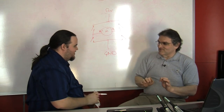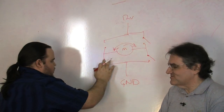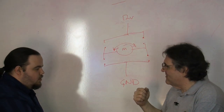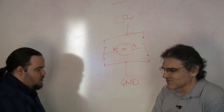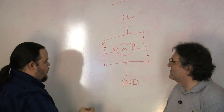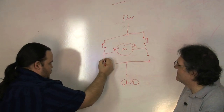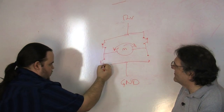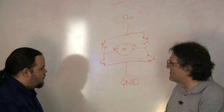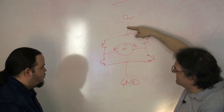You don't want to sit there and actually deal with switches and having to control multiple ones — that would be a pain. We have a wonderful part called a transistor, which is an electronic switch, among other things. And there's two different varieties: there's positive and negative, P channel and N channel transistors. We're going to use PNP transistors on top, and those have the arrow pointing towards the base. Same thing over here. And then NPN transistors down here, which have the arrow on the bottom pointing away. Now, we use conventional current flow for the symbols we use, so the arrows always follow the direction of current flow — from positive to negative. Thank you, Ben Franklin.